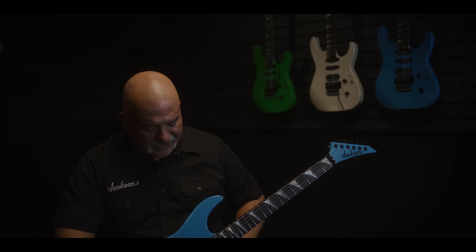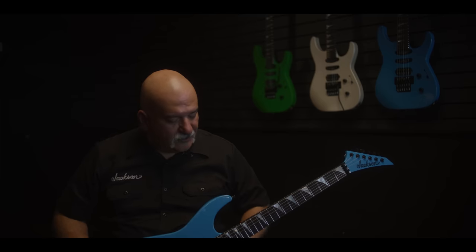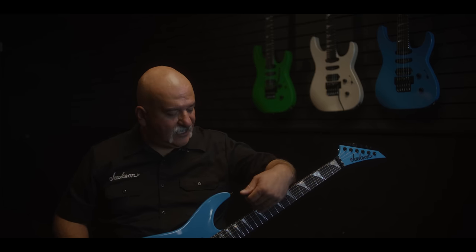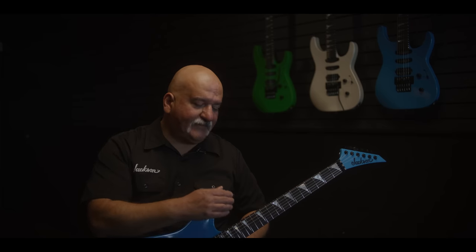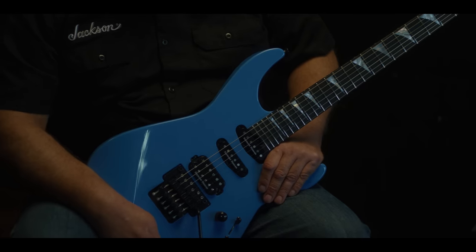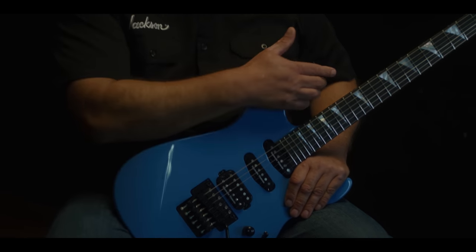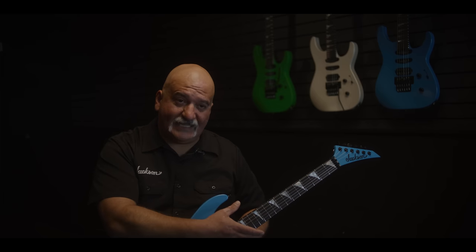One of the issues that came up, and I'm pretty proud of this, if you notice, this guitar doesn't have binding. So if you don't have binding, when they cut fret slots, they usually cut them with the saw and it goes all the way through. And then you either fill it with putty and paint, but eventually over time it's gonna shrink and you have a little seam line on the sides. So if we're not gonna do binding, and I don't want that because it's a pet peeve, we milled the slots. So each fret slot is a little pocket. The tangs are cut as if it had binding. It's like the binding's built in.